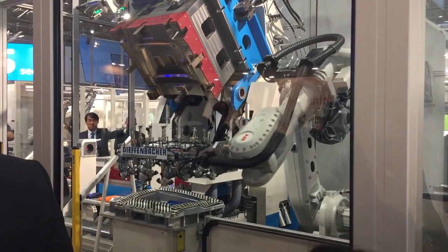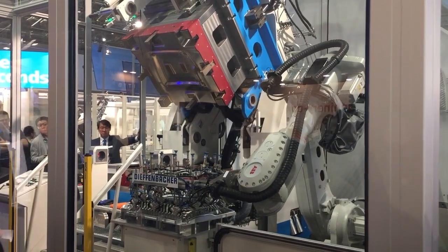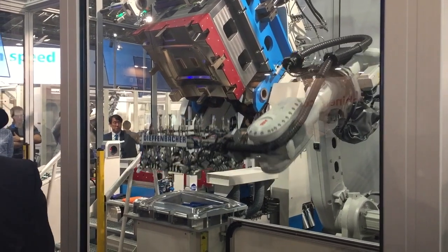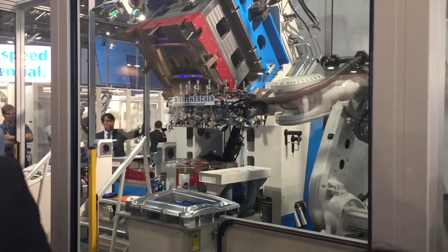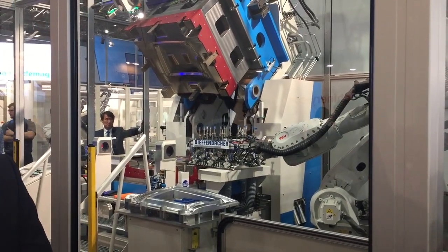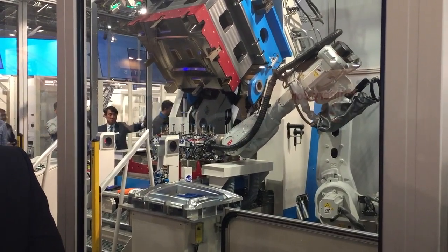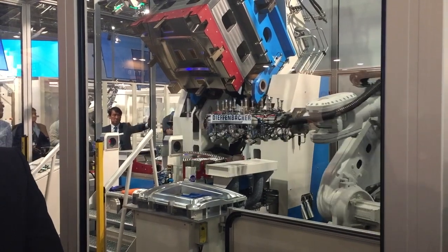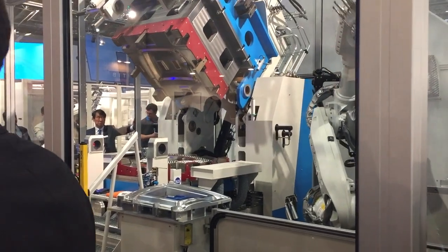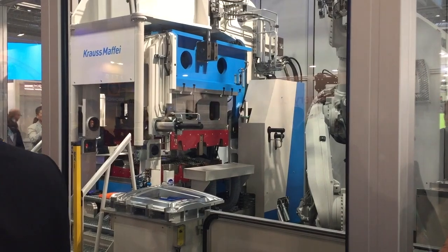The process is just getting started. Our robot is now grabbing those four sub-preforms with its needle grippers, and it's also picking up the aluminum insert with the vacuum gripper. Now placing those parts — first the aluminum part, and after that those four sub-preforms — into the mold. In just about a second, the mold carrier will chuck the mold. And while this is happening, in the background, the caprolactam is already getting melted and prepared for the process. Now it starts circulating inside of the system.